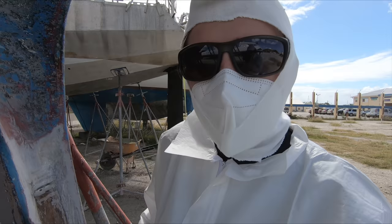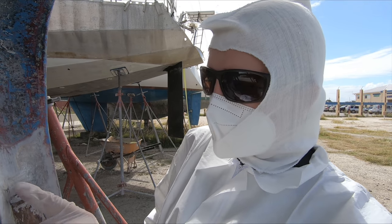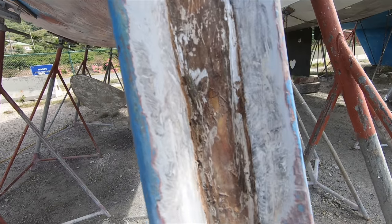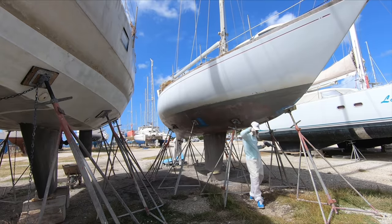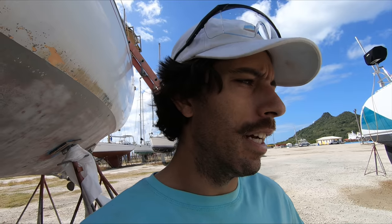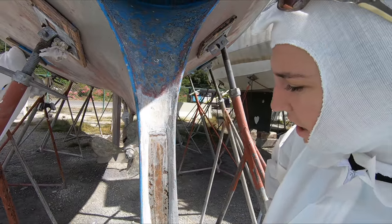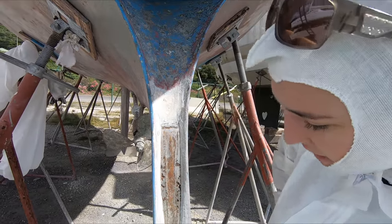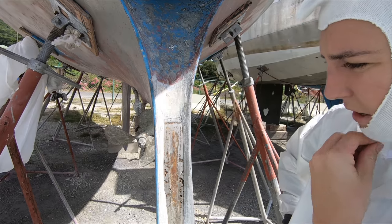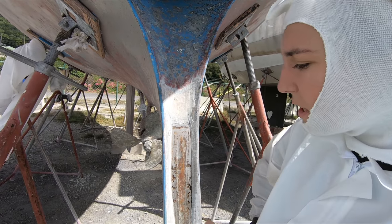How's she going? I'm just trying to find a place where the fiberglass is actually bonded to the steel. I keep discovering more rust around the sides, but up here I think that's a good spot. Michael's making a lot of progress — there's really not even a skeg left after all she's been doing. I noticed all this pitting in the metal, and it was actually only this strip in the middle that was exposed. All of this was underneath the fiberglass and it was still kind of rotted away under there. So instead of grinding all this back, I'm going to take a wire brush on the drill and see if I can clean it up to where it's all nice and shiny.